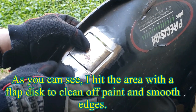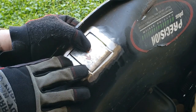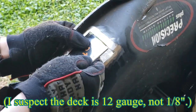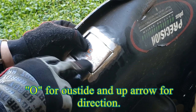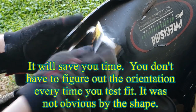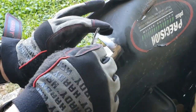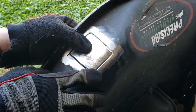I've got my patch here - you can see a pretty good fit. I want a little bit of gap of course. I did kind of bevel the edges. This is 1/8" material, same as the deck - pretty thick actually, I was surprised. I marked the patch to indicate where the outside was and which way is up, just because every time I would shape, grind, or smooth it, if it fell I didn't know which way was which.